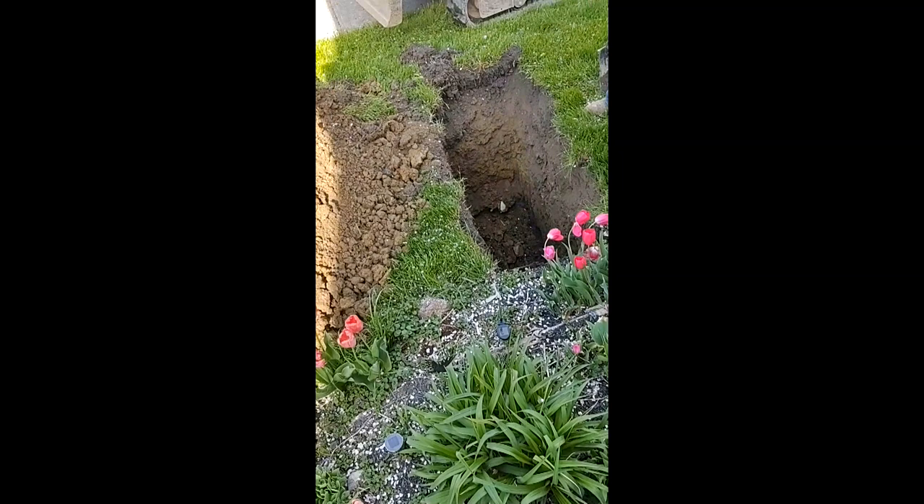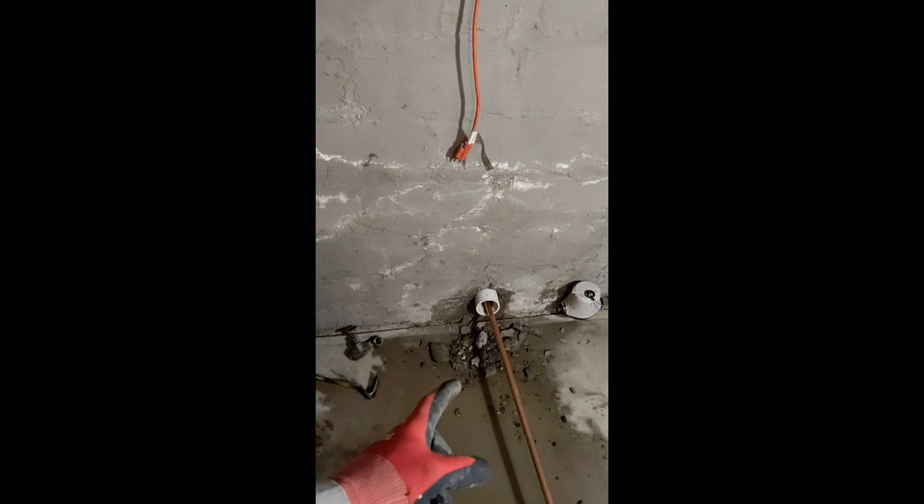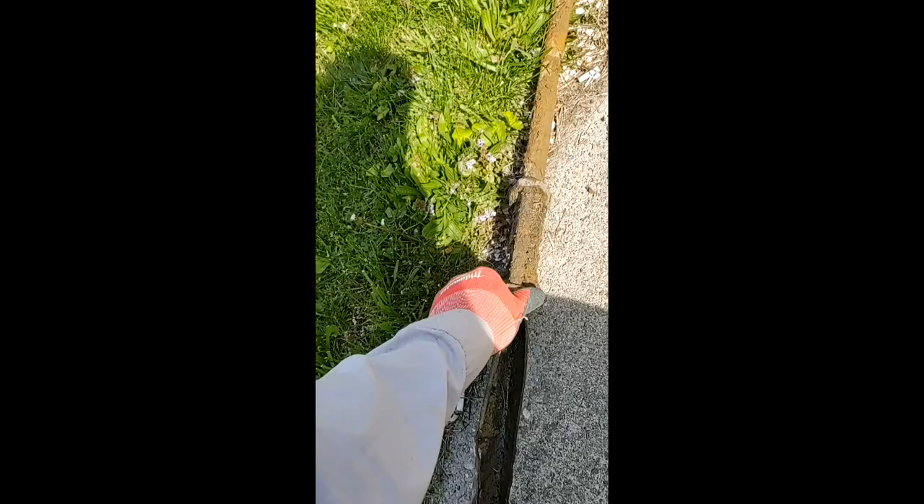Looks like we're back in business. There was a dresser coupling out there in the yard, buried in the dirt along with a whole lot of trash — just stopping the entire progression. Ideally it would have pulled the whole pipe through, but with a massive coupling that wide in the way, it never had a chance. Here's what we've got: makes perfect sense why we were unable to pull the whole line out — it's basically an anchor in the earth.